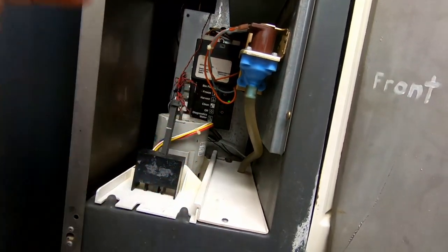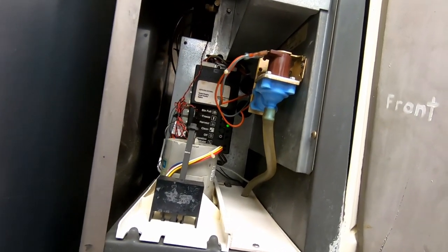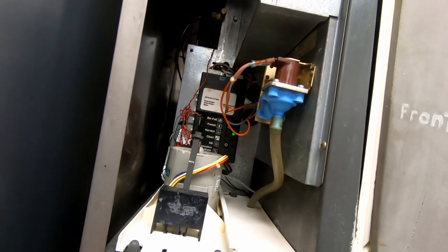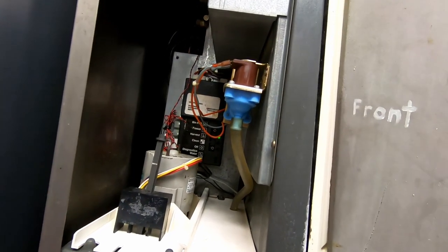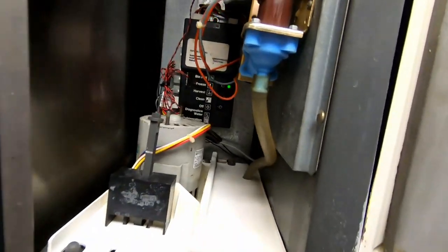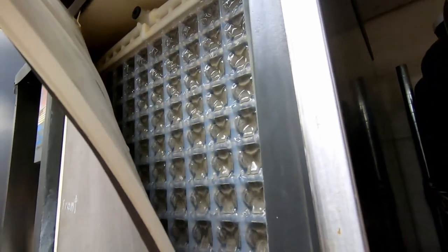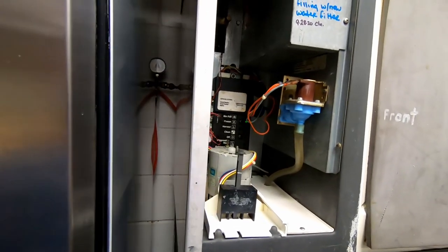The first harvest on power backup is a lot longer than normal, but once it's running I believe it shortens itself up a little — it's kind of getting a baseline. I think we sold Scotsman long ago and now we do Manitowoc, so I don't always remember everything on them. This should go back into freeze here any minute. It went back into freeze and it's freezing down, so I'm gonna say we're probably good to go. The water seems to be trailing across the panel pretty good. If you guys like the video and want to see more like it, make sure you subscribe and click that thumbs up button. We'll catch you guys on the next one.